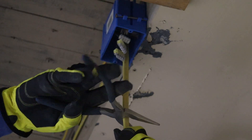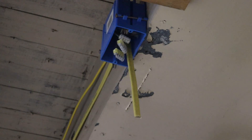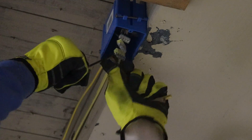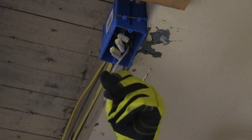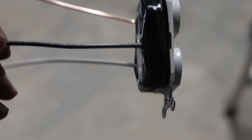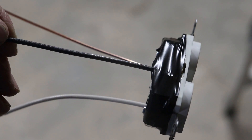The wires in this junction box are super short, and so that's where those little connectors come in and work really well for this application. The wires from the new line are going to get stripped back and just plugged into the connectors. I've used some extra wire to put on some pigtails, and I'm just going to go ahead and plug these into the connectors.